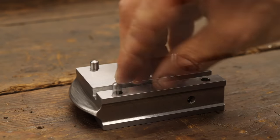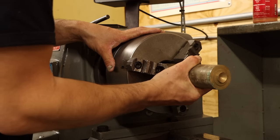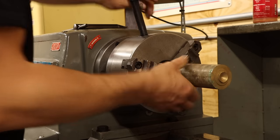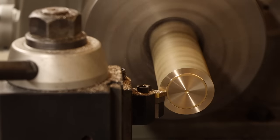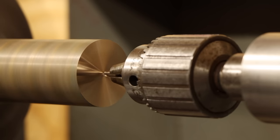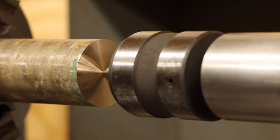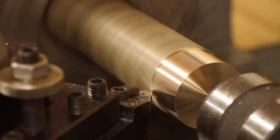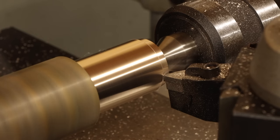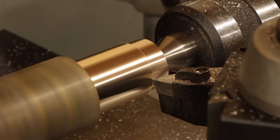After two days of machining, I have a whole four parts to show for it. Feeling a bit rejuvenated by my success with the pins, I'm excited to start machining with some of my favorite material — brass. There are three knobs to make, and I think I can manage them all out of this one setup. Some of the coming operations will be pretty high load, so we'll center drill the end for tailstock support, then turn down the length. This is why turning brass is so fun — it just cuts like butter, and the surface finish always comes out beautifully.